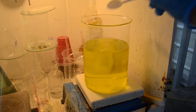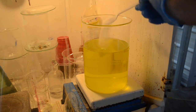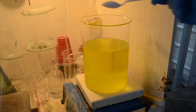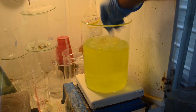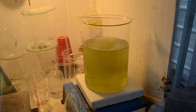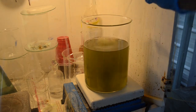Okay, in goes Stump Out by Bonide. Sodium metabisulfite is the active ingredient, and that's what's going to drop the gold for us. Okay, let me give it a stir. I do believe I see the color changing some already. I'm going to put a little bit more in because there's a lot of... oh yeah, we're getting a color change. We're definitely getting a color change. Not seeing the white foam that really tells you you've got enough in there. But boy, are we getting a color change, so maybe we have enough.